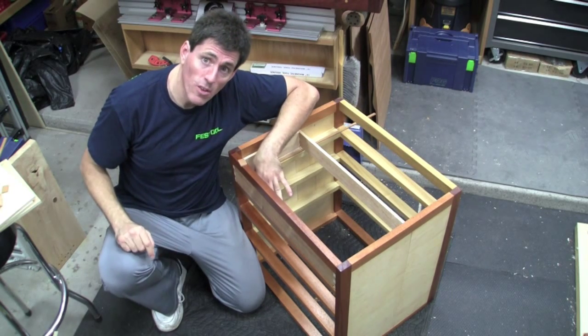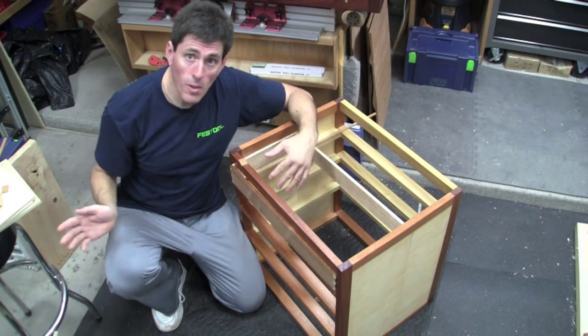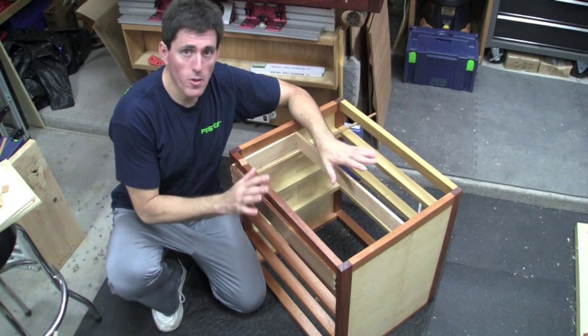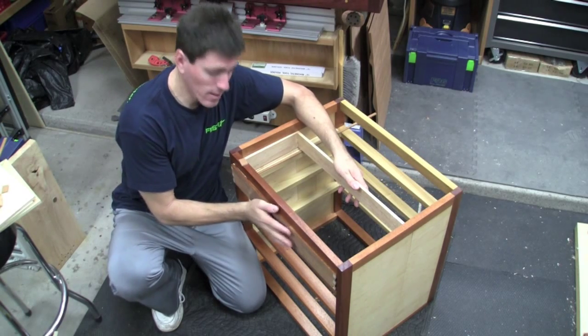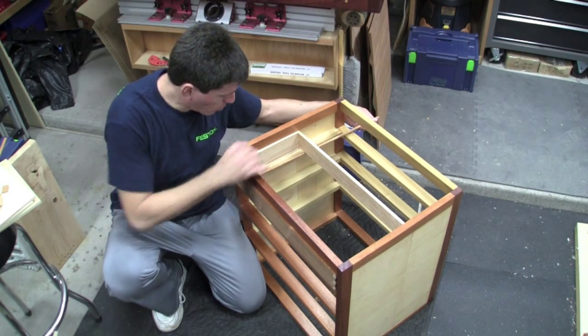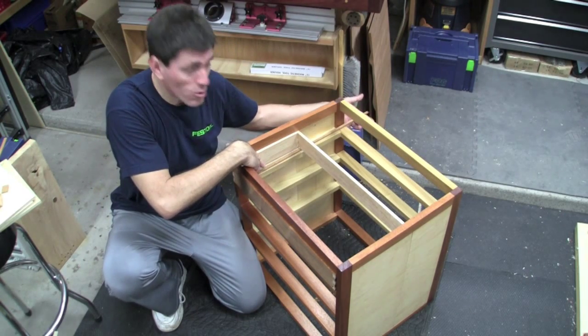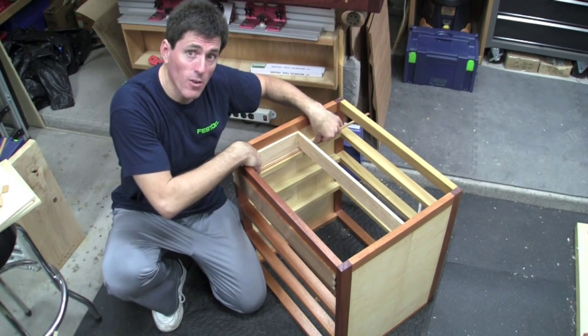and then I'll fire one nail into the front. And then I'm going to take this drawer out, put the plywood base into it so that we can make sure that it doesn't change any dimensions after you put the ply in. Slide it back in until it hits these stops. And then from the back, I can rotate this until it's touching the drawer. So then at that point I can shoot a couple nails back here to lock it into place.